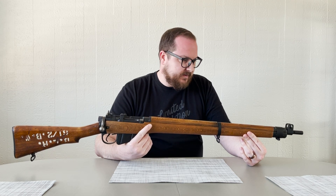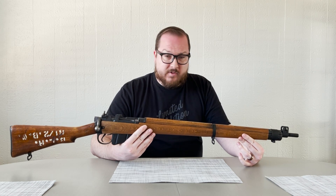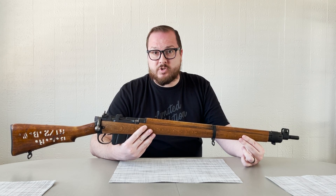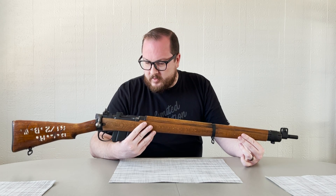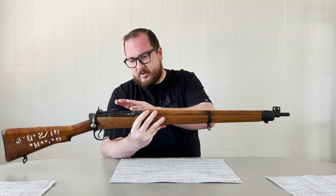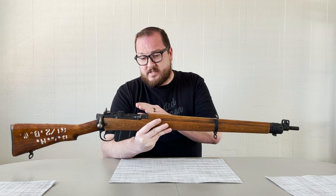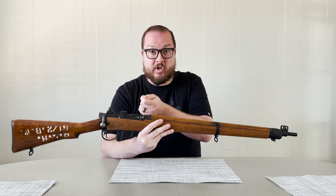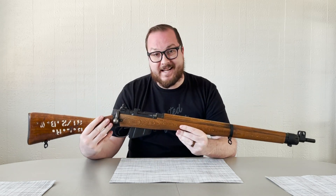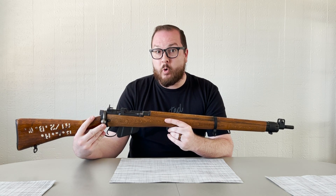In this case I just did it with a low shine black, sort of their satin black finish, and it goes on quite easy. I've documented this process thoroughly on my Instagram page — highly recommend checking that out at Booligan Shooting Sports on Instagram. For the rifle itself, I had to refinish all of these metal components including the receiver and the barrel. The receiver and barrel wouldn't fit in my toaster oven, so I had to hit them with a heat gun and let them sit and cure for a while. Not an exact science, but it is better than just letting it air cure. The Duplicolor engine enamel does air cure; it just takes quite a while to do so.